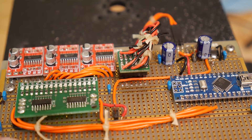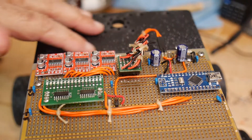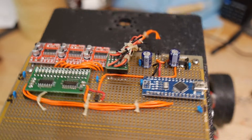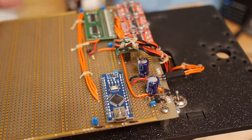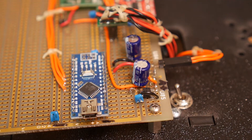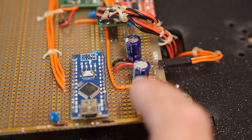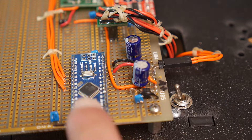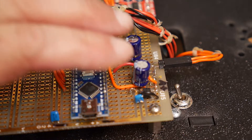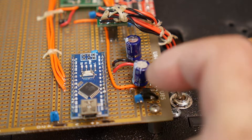The next thing I'll need to do is add a battery. Right now it doesn't have one. I'll put the battery over here and maybe a charging circuit so I don't have to pull it in and out all the time. It has a little voltage regulator here — power comes in and gets changed into five volts for the Nano and the shift registers. The six-volt raw voltage goes into the H-bridge, so the motors run off raw power and the circuitry runs off regulated power.